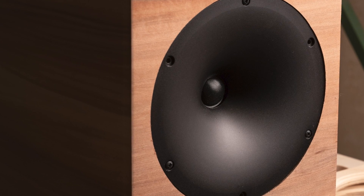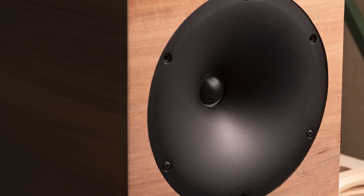You can definitely mold plastic and put ribs into it to stiffen it, but generally you need to fill it with some kind of damping material to keep it from ringing in the cabinet. This one, because it's so thick and we left so much of the aluminum on there, definitely isn't going to ring at all. The amount of energy it takes to cause this mass of aluminum to ring is much more than you can get from standard use in a cabinet.